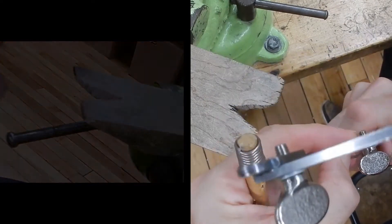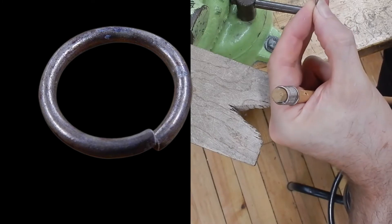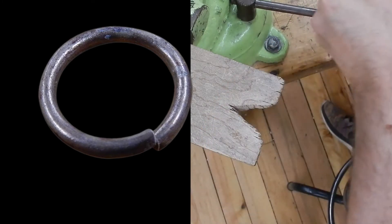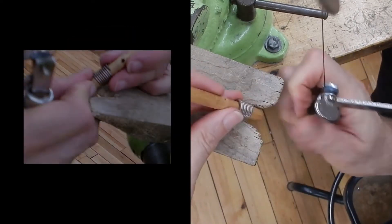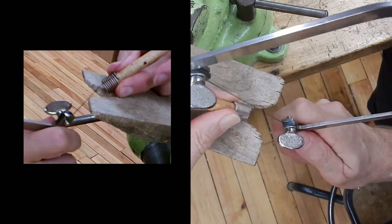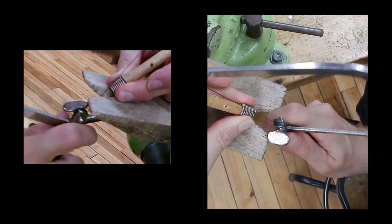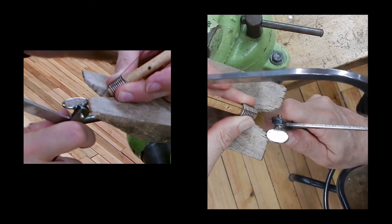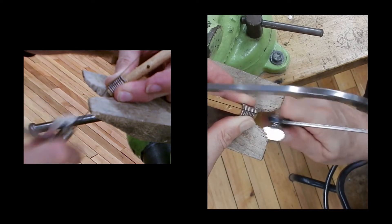There's my very first one — a beautiful, perfect little jump ring. I'm going to keep going and cut the rest of these. I don't actually want to cut one at a time; I want to cut on an angle so that I'm starting the cut in the next one as well. It's going to make it more efficient and use the groove in one to guide the groove in the next, so they all end up being more consistent.